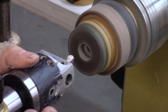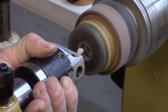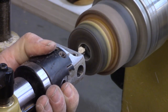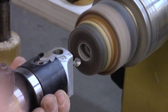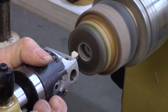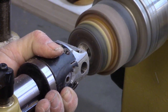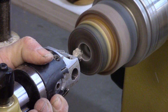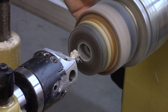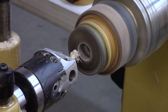Does it come with a draw bar? It does not. It is drilled for one though. So that was 1/100th, and I can see that I'm actually cutting, but you can't even see a shaving. Now that's 10/100ths. If you were doing brass or some other metal, which that cutter should be able to cut, you would want to cut 1/100th. You would want to cut it small, and slow your feed rate. So it's a slow feed, high speed, I think, with a metal lathe. Anyhow, I'm not a metal lathe guy, but...